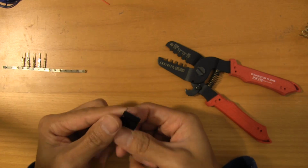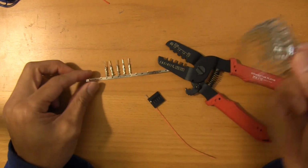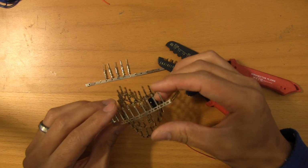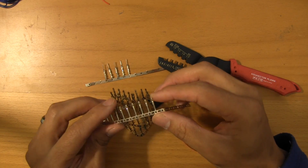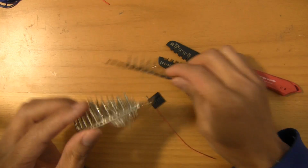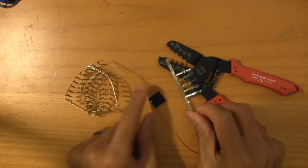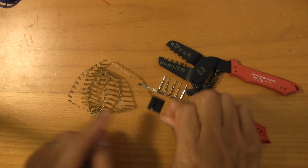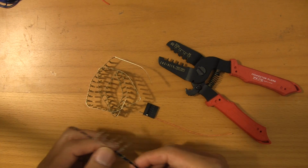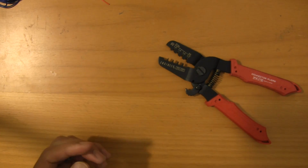And by the way, these pins and housings, you can buy these on Pololu or on Digikey if that's your thing. But the female pins, these come in a roll of about 100. They're $6. Buy these in a 2-to-1 ratio to the male pins. You'll use these more than you'll use these. But yeah, you can get these plus these connectors at Pololu for, I just put in an order there for like $20, and then that'll set you up for a really long time. All right, so that's the servo pin connector.